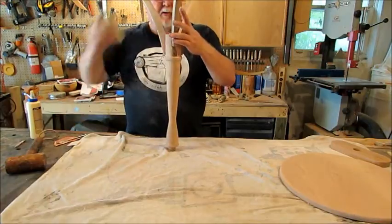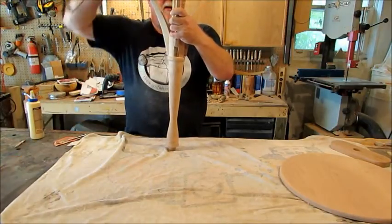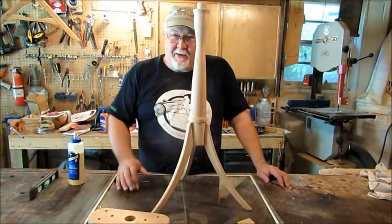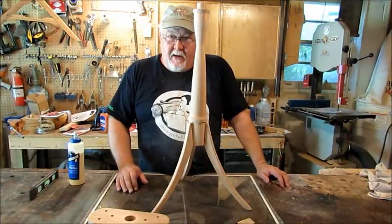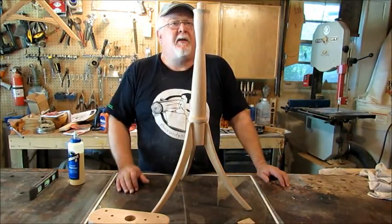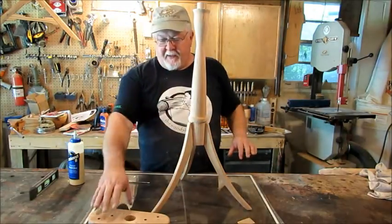Turn him up a little bit, put a little block there. Well, came down here this morning, did a little clean up and touch up on some of my joinery. I had to do a little sawdust and CA glue slurry in a couple of spots, sand them down, but they won't be seen. Finished touching up everything.